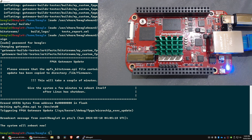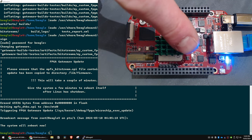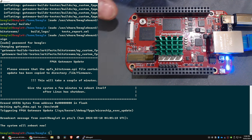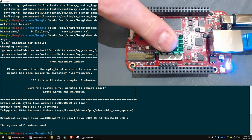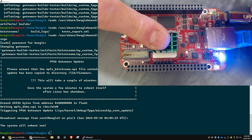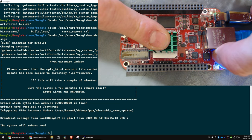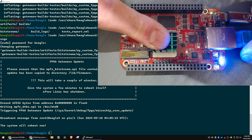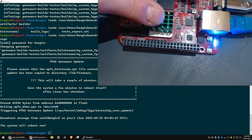It's really burning — the LEDs are going to stop doing anything whilst it's writing to the FPGA. This bit takes 30 to 60 seconds. Snakey! Look at it go. You can make it faster or slower just by changing how many counts it takes to tick. And in theory — there we go, it goes the other way when you hit the button! It's a bit dicey since I'm not debouncing it at all, so the button might not be perfect, but that makes me so happy.